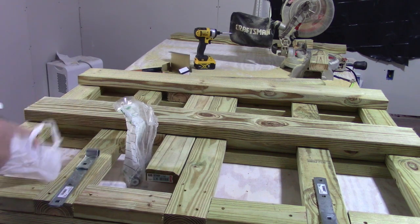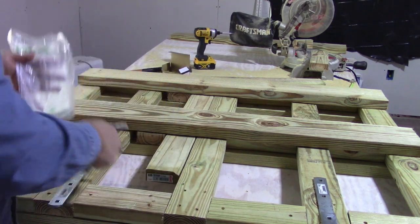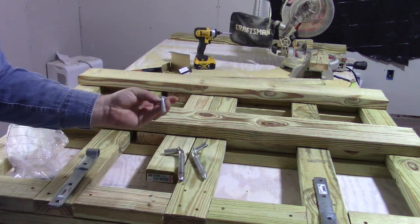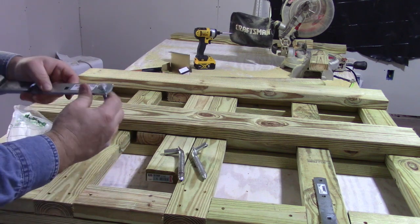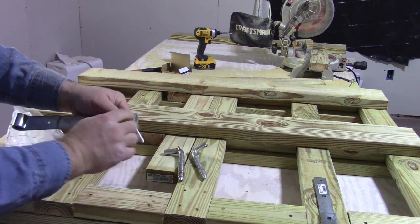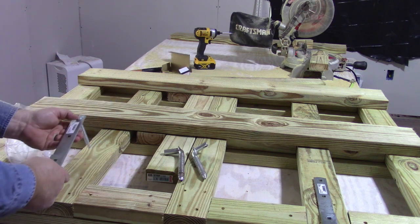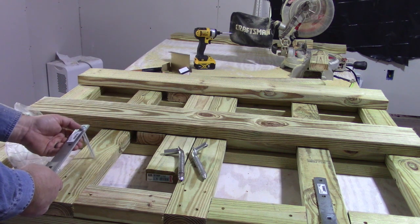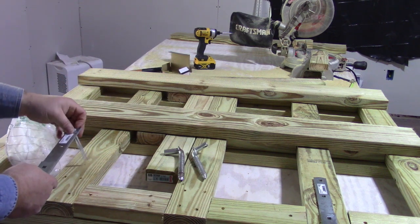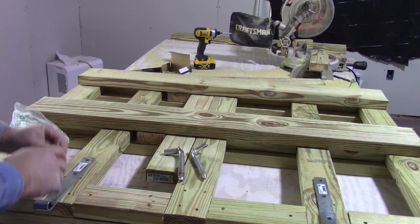So I got 2 of those. And the sack's good and muddy. I got enough carriage bolts. Carriage bolts have a square shoulder, so when they go into here, they'll lock in and it won't turn, it won't allow the bolt to turn. But this will be smooth enough that I can get another plank over the top, but well, I won't even have to worry about that. On this one, I'll probably end up having to grind the end of that bolt off, but on these, I'll have a piece of wood going over the top of it, and they'd be pretty smooth for that.